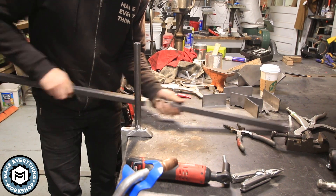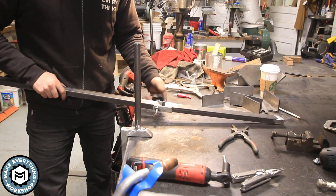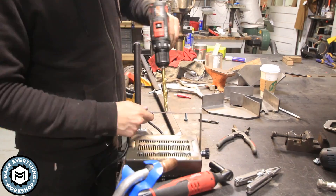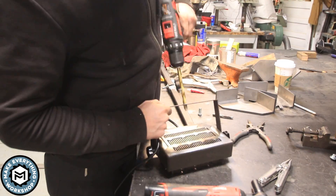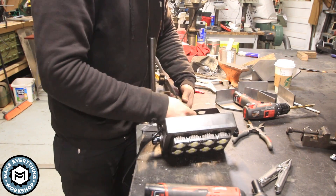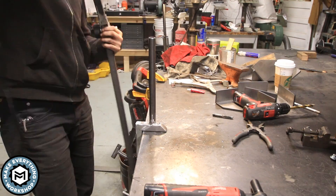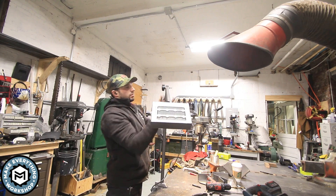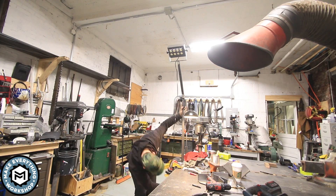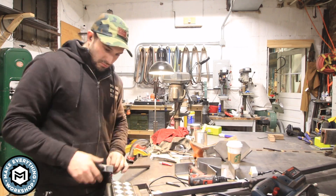You can see how easily the 16th wall tubing spins around on that piece of pipe sticking out. I can kind of do my first test assembly here where I put the things together and make sure that I get a good enough grab to hold this arm at any position even with the weight of the light in there. I did have to drill out the bottom of the bracket that came on the Sansi light to use the 3/8ths hardware, but once it was drilled out I was able to get this 3/8ths by 1 inch bolt in there no problem. You can see how positionable it is and I've got that cord sort of right where it needs to be at the very end. I can use the plug-in switch that I mentioned earlier and a little 2 foot extension cord to give me just enough accessibility.